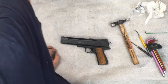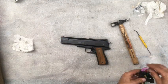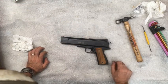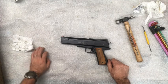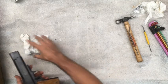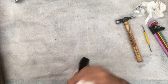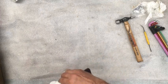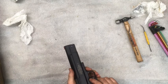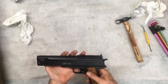And that, my friends, is it. Not a big job at all, nothing fancy. All done with a screwdriver, pointing tool, little hammer, a drift pin, a couple of Allen wrenches, and the clamp itself. Now I guess we'll put it on the chronograph and see if it fires any better. I'm not going to show you that because there's plenty of them on the web showing you that they can shoot down targets. HW-45 - change the piston seal.